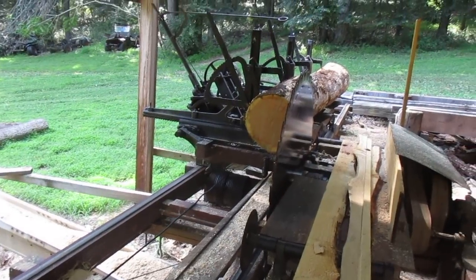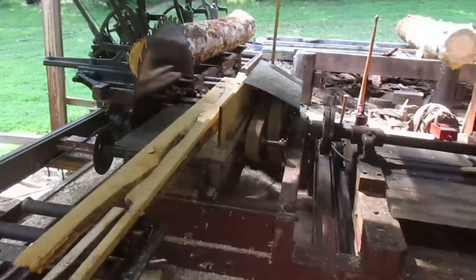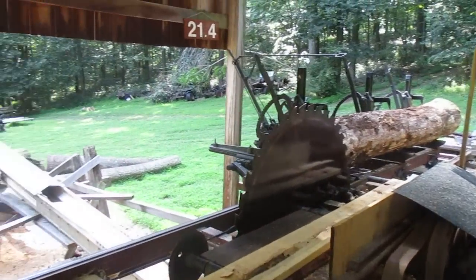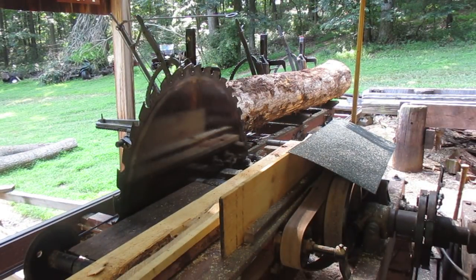So I think that was a good call on that viewer — just better to change it. I'm going to pull that off. The worst thing about it, I was going to saw that log this afternoon, but it's probably about 4 o'clock now and it's just too dang hot. These blades don't like hot. The heat expands things a little bit, and on a 4-foot cut when that heat expands, it just doesn't saw good.